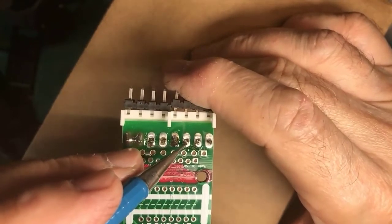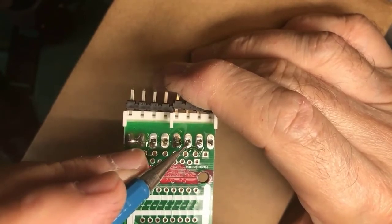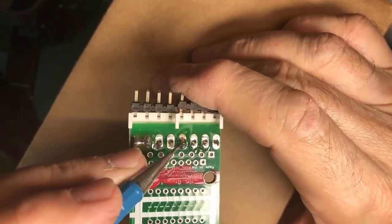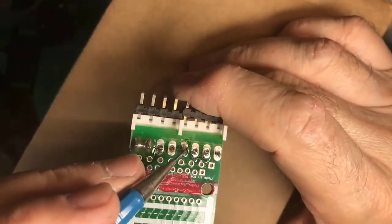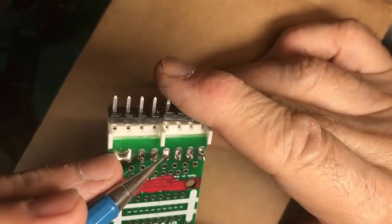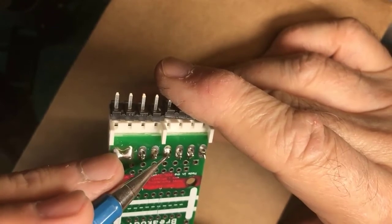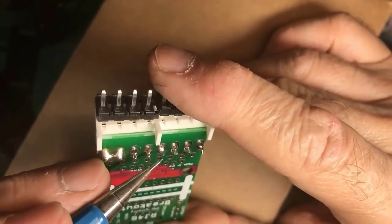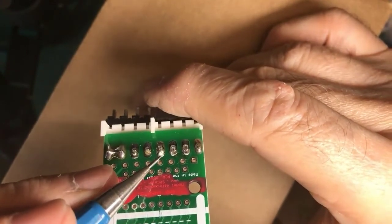You want to apply enough solder to fill the hole, because when it is full all around the lead, it is now fully supported so that it's much stronger mechanically. This lead here with solder all the way around it is very solid. You can depend on the joint. Now, let's note the way the solder is nice and silver, and here's the tent shape that Chubb talked about. It flowed out onto the pad and it flows up onto the trace. And it's like that all the way around. That's what we're looking for.